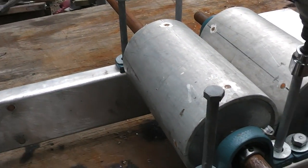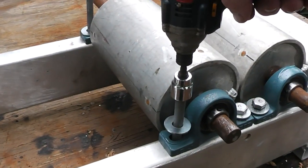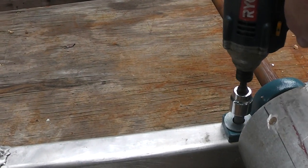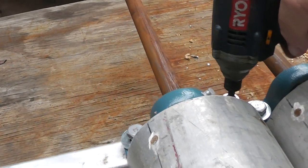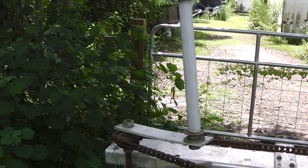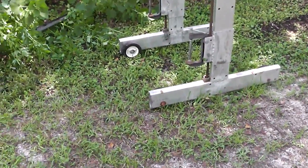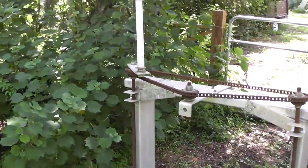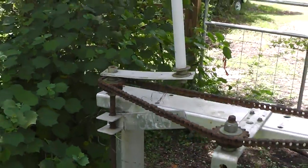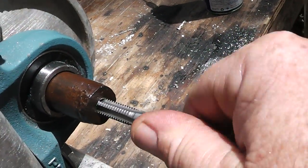These bolts are a little stubborn - I could hammer them through but this is going to do less damage to the thread. I need to make a handle for my cane grinder. This is a handle I made before YouTube for a chainsaw sawmill - you can see how simply the handle works. I tapped that out in my one-inch cold roll steel using a three-eighths tap. I'm going to make something probably a lot simpler than that.